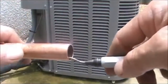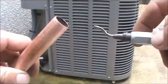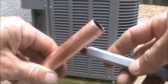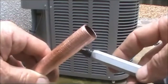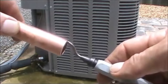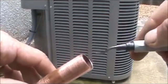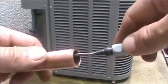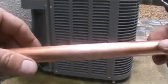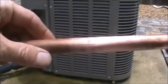One thing to note: if you have a piece of pipe that's open on both ends, you don't have to pay attention to where the shavings go. But if you're working on a system where only one end of the pipe is open and the pipe is in an upward position, all those shavings are going to fall back down inside the pipe and cause problems in the future. It's best to get your vacuum, or position the pipe downward when you deburr so the shavings fall out. If the pipe goes upward, hold your vacuum close to suck out any pieces. Get the pipe completely deburred and clean, making sure there are no spots that would prevent the silfos from flowing.